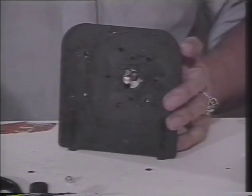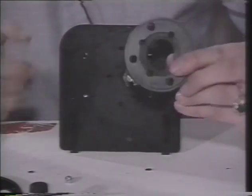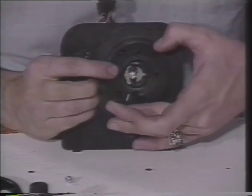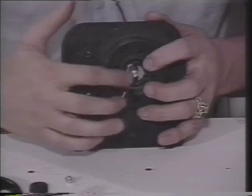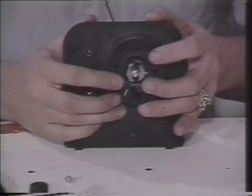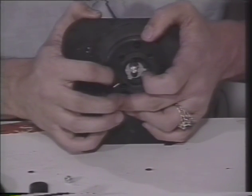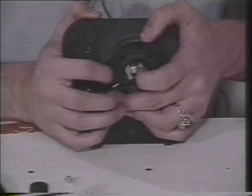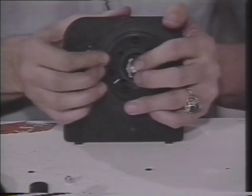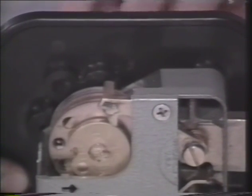An even better one comes with our little opening kit. This is a drill guide. The guide fits on the lock and screws into the 2 holes that actually held the dial ring on the lock. At this point, one simply takes a hardened drill bit, drills into the hole required, being careful not to drill too far, and using this as a drill guide. This supports the bit. At this stage, we turn the dial several times to clear the pack.